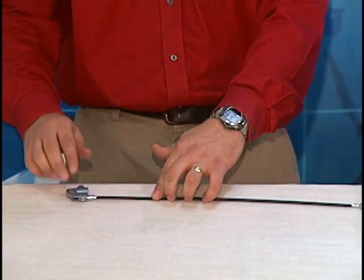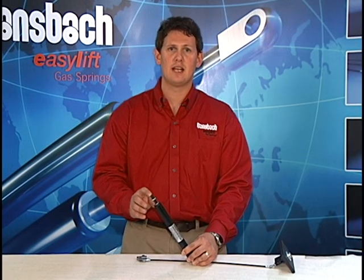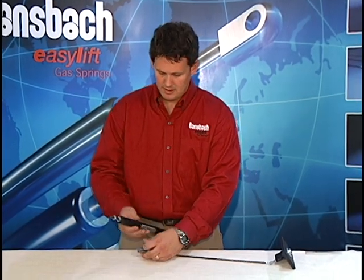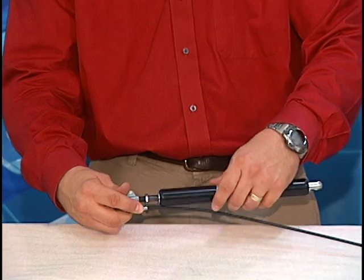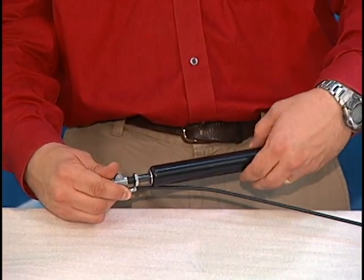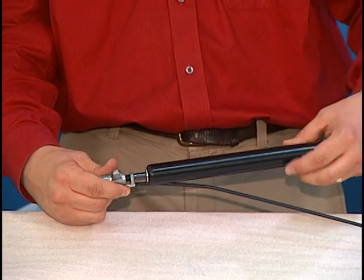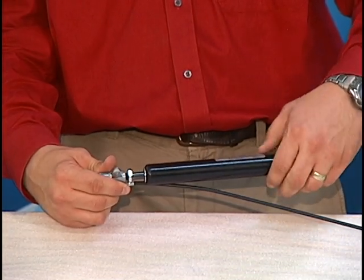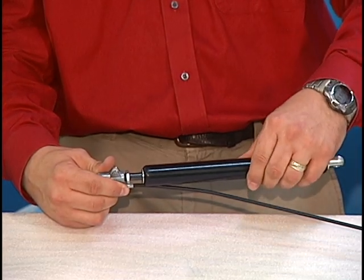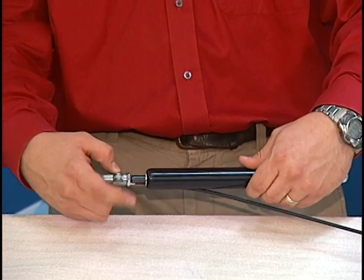Now we can install the locking gas spring. This is an easy touch locking gas spring where the release pin on the rod end is two millimeters, as opposed to a standard locking gas spring where it's five millimeters. Take the release head and screw the gas spring into it very slowly, just until you feel the release pin bottom out inside the release head. You don't want to go any further — that will extend the gas spring ahead of time. Go nice and slow. Right about there I can feel the release pin touch the inside of the release head. At this point I'll tighten up the jam nut to the base of the release head.